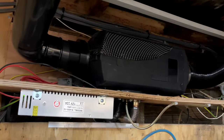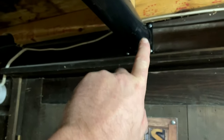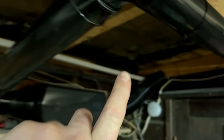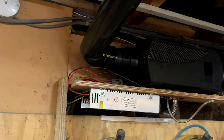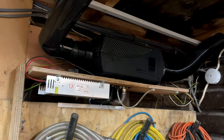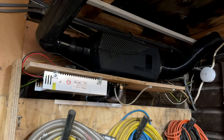So here's the heater, still where it was originally. The only thing I have done is I've taken a pipe to take warm air from the workshop through along here into the heater. The reason being is because it's quite cool in the garage all the time and it was drawing in cold air. So I thought, we're heating cold air all the time — with this way we are heating warm air that's already in the workshop, so hopefully it's going to be more fuel efficient.